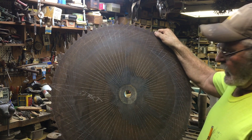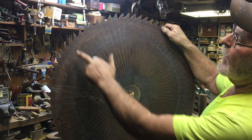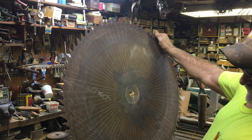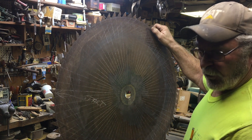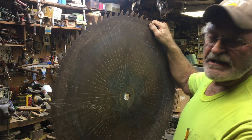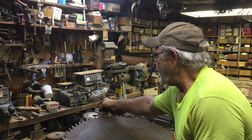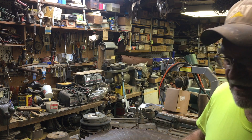Here you have it — the completed blade. I've got the gullets all fairly evenly the same depth, all the way down to our gullet radius. We've got the angles the way we decided they needed to be done, and it's looking really pretty doggone good. There were some obvious rough spots along the way, and in using the machine I found out there are some things that need to be adjusted — like the set screws keep bouncing loose, especially whenever I was hammering on the blade actually setting the teeth. Those things kept bouncing loose on me, and that's not good.